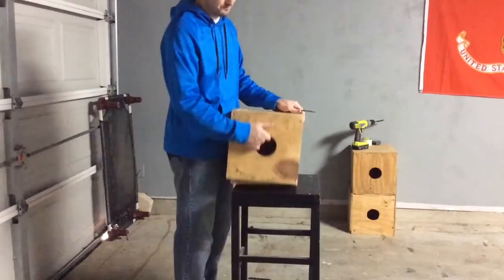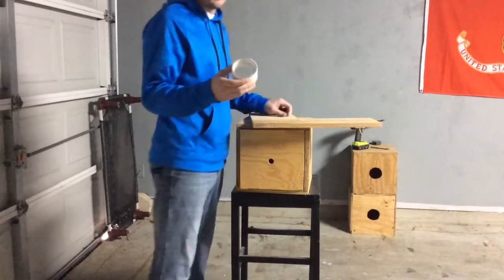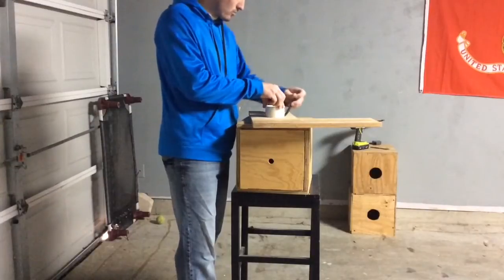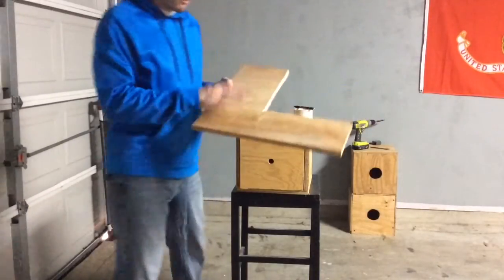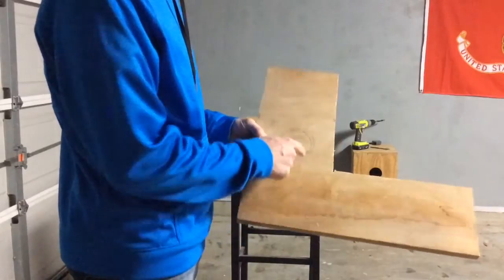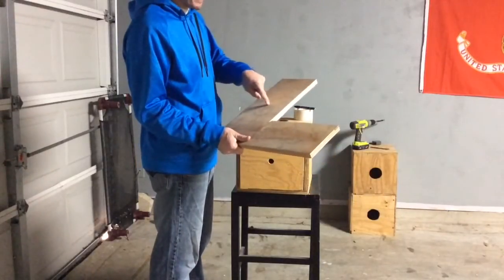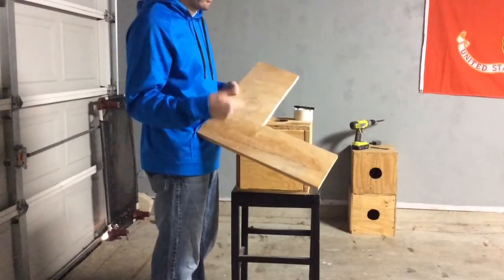This is the last step — making the hole. Very simple. I just use a roll of duct tape or masking tape, whatever kind you want to use. There are two sides to consider: the inside and the outside. I want to show you there's a difference in size. It's up to you how big a hole you want — I'll show you there are two different sizes, not by much. I usually go with the outer size; it's a little bit bigger, but it's up to you. Get your paddle drill bit, put a hole in the center, then get your jigsaw and trace that circle around. If you don't have a big enough paddle drill bit, you can use a regular drill bit, as long as it's big enough for your jigsaw blade to fit through the hole.